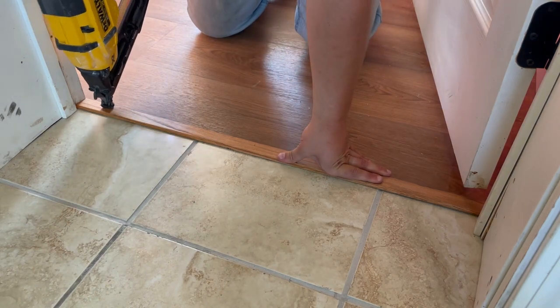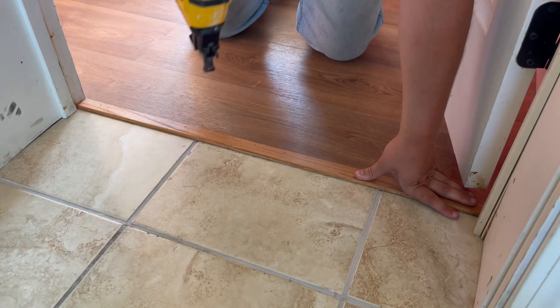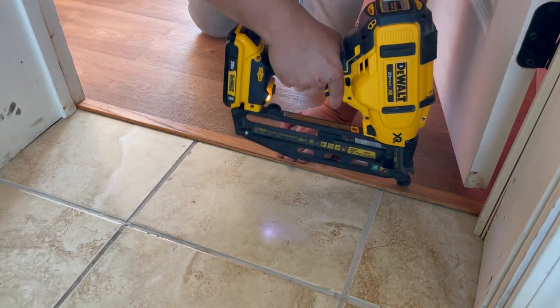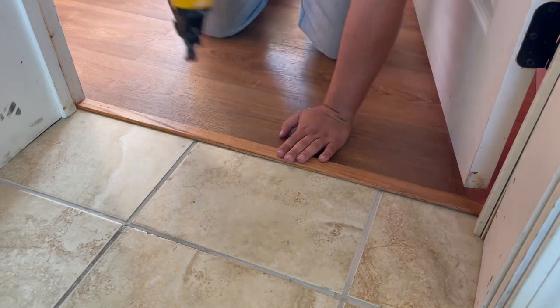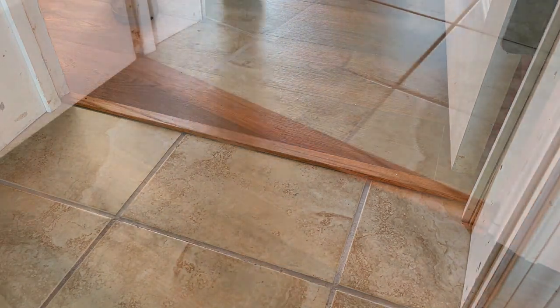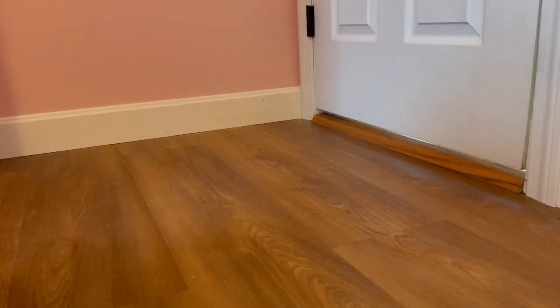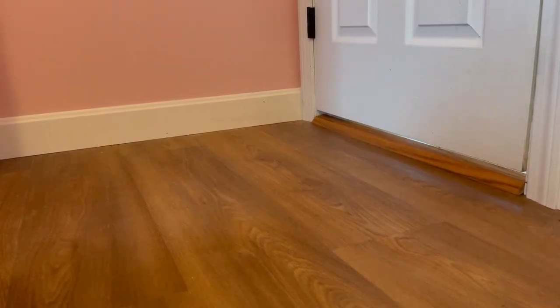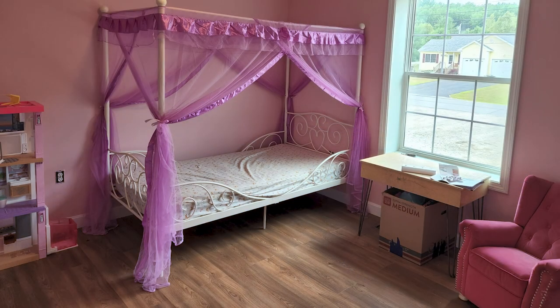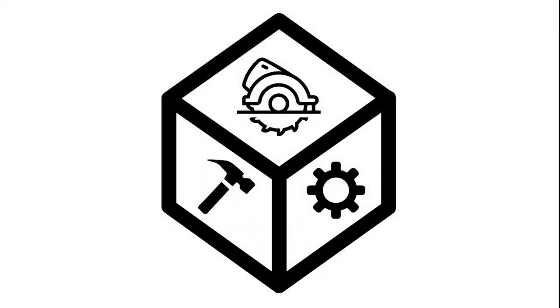I add an oil-based finish that will darken the transition to close to the same color as the flooring, then set it into place and secure it with some finish nails. You can use trim screws here if you prefer — either way, just make sure that you go directly into the subfloor below, not through the tile or the vinyl plank. And with that, this project is done. We found this type of flooring to be a huge improvement to carpet in our house — it's reasonably priced and anyone can install it with almost no tools. Thanks for watching, and we'll see you on the next one.